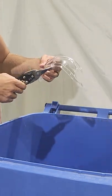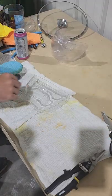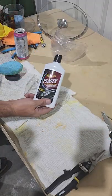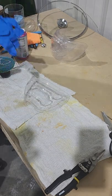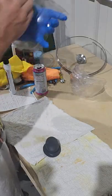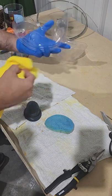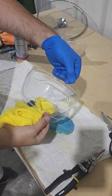Now we can start to work on dyeing the visor its golden yellow color. Before we dye the visors we want to make sure the surface is as clean as possible, so we're going to scrub down both sides with PlastX plastic cleaning solution. I'm going to buff out both sides of the visors making sure I'm wearing a glove so I don't get any fingerprints on it, then drying it off with a microfiber towel.